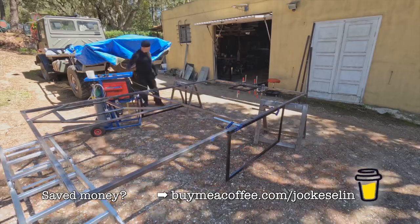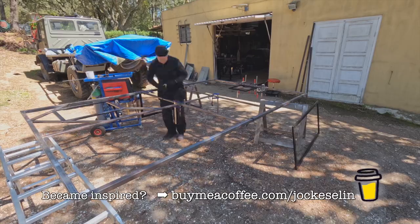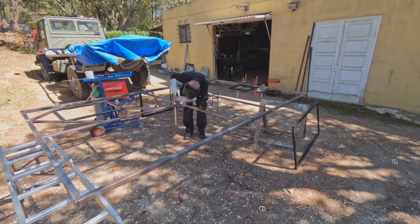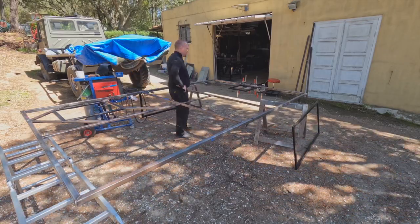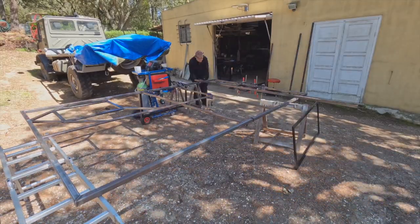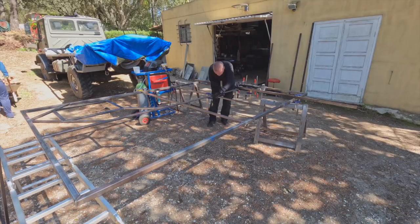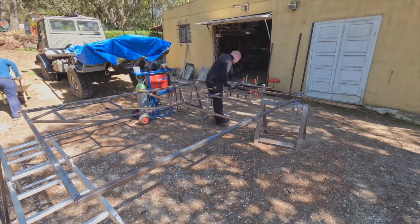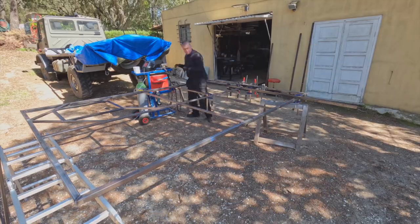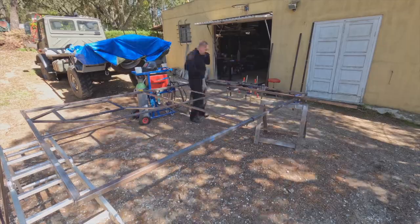And then, like a thought in a brain, I think I have an idea. Let's continue the center bar. That means adding one bar between the side-to-side bars, and then adding another one forward to the vent hatch. It's an easy and cheap idea, but the central bar will help me divide the problem into smaller pieces. Instead of two open areas, I now have four smaller ones that I can deal with individually.